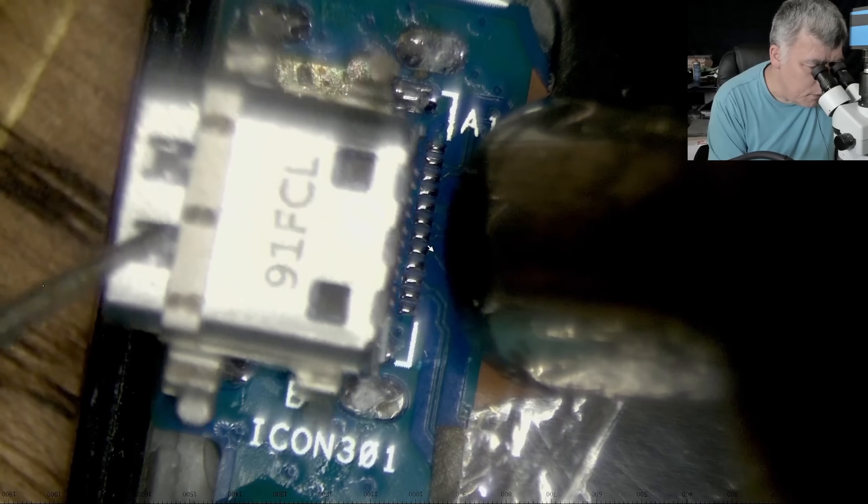Now I'll come with a solder iron and use a normal solder wire. This one is getting melted around 280 degrees on the sides, because we want to make sure the job will not come back. Let me use some rosin — rosin is very good for this kind of job because rosin has a higher boiling temperature so it's not evaporating so quickly. Now, on the other side.